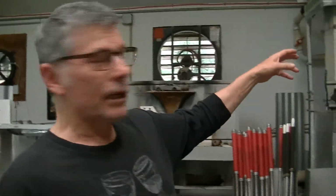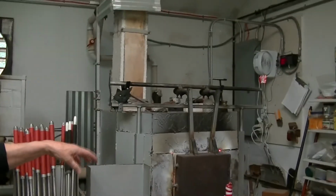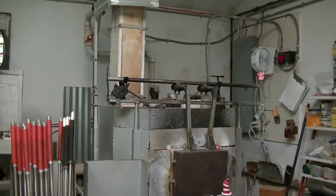Working temperature is 200 degrees below melting. We're melting at about 2,350. And the furnace is the opposite of a wood stove. It's designed to keep all its heat inside. And we have a recuperated burner system that preheats the incoming air with waste heat from the exhaust. So we scavenge heat that would normally leave the furnace, and return it to the furnace by preheating the air.